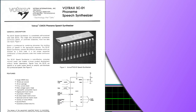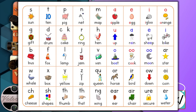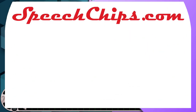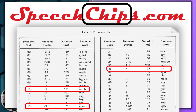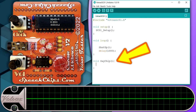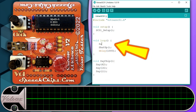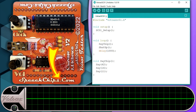Like all phoneme-based synthesizers, the Votrax produces speech by stringing together the sounds of phonemes — the building blocks of speech, the individual sounds we make when speaking. For example, if you say 'chip,' you are making the three phonetic sounds ch-i-p. To get the Votrax to make those same sounds, we look them up in the Votrax phoneme chart, retrieve their numeric codes, create a routine that sends those numbers to the Votrax, and then call that routine from our once-a-second repeater loop. Then we upload that program to the tester board and listen.